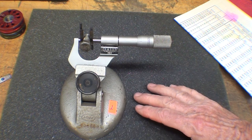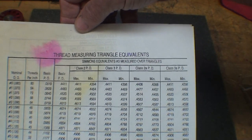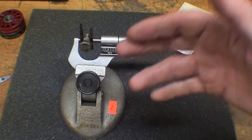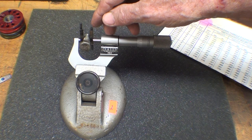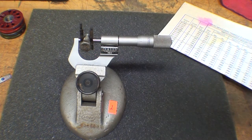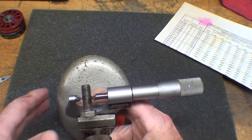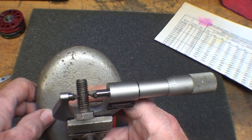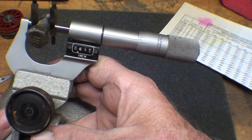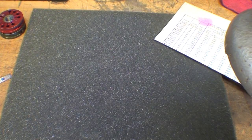I changed my mind and want to insert this about the thread triangles, because I just found the chart as I was putting things away. This is a 3/8-16 bolt, and I've held the micrometer in a stand simply because it's so awkward to do this. Originally there would have been a little rubber harness between the two legs and also one on the bottom, but those have long since rotted out. Measuring across the triangles now — my reading is 676, almost.